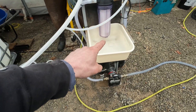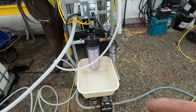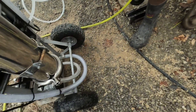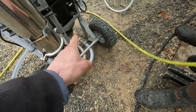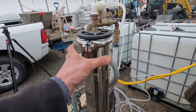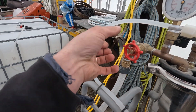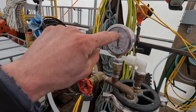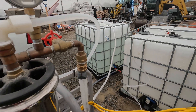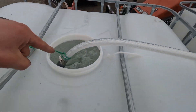I've got it going in the bottom, up to the top. I changed the filter after I did my wash, so that's a fresh filter — you're going to want to change this filter after every batch of sap you do. Running at about 40 PSI, that's what this pump is producing. Then we go out into the high-pressure pump, come out of the high-pressure pump, and into the outside of the membrane. The whole outside of the membrane is being pressurized. The easiest path is out where the gate valve is, but we've got the gate valve closed to build up to about 200 PSI, which forces the water through the membrane. So we've got pure water coming out of this tube going into this tank — this is where I store my clean RO water. And then this line is concentrated sap, which goes back into the top of the tank.